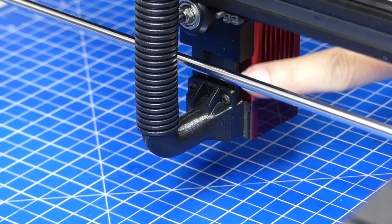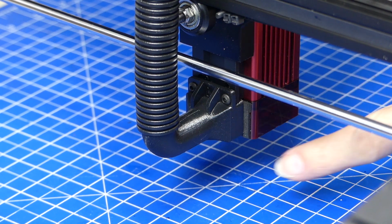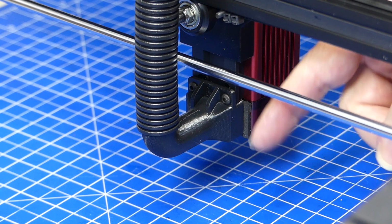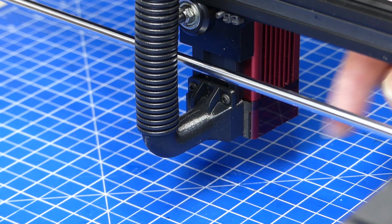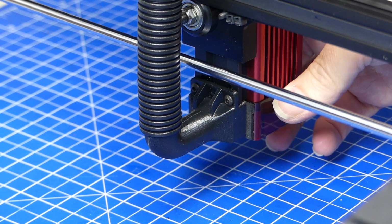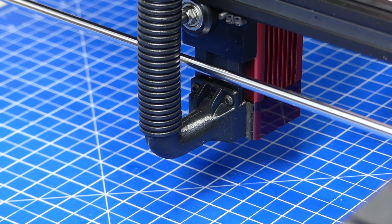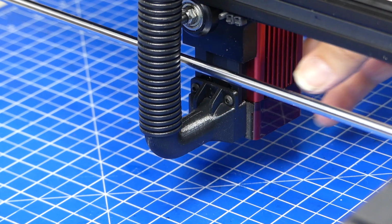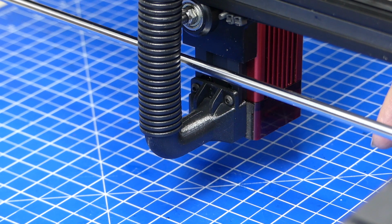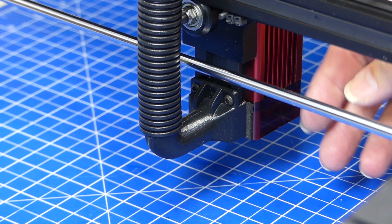Now, when you look at the back of the laser, this here's the laser module. This here is the removable shroud. There's this little piece here that looks like part of a vacuum cleaner. And what you want is for the removable shroud to touch this thing really well, so all the fumes produced inside of here are exhausted through the pipe here and into the filter and through the fan. And this part here was slightly too long, and I just sanded it down. It was very, very simple, very easy to do. And now the shroud actually sits absolutely perfectly.